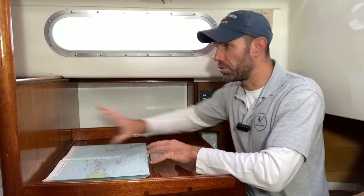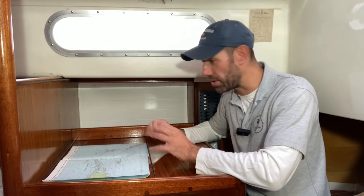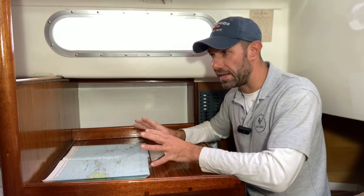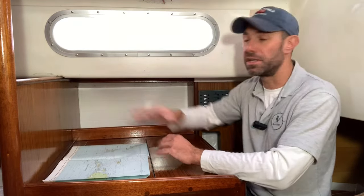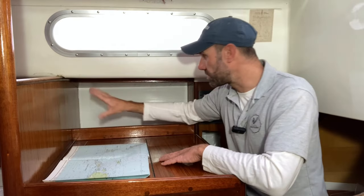The first thing I had to do was chip off all the horrible old formica. If you've ever done that you'll know how ridiculously razor-sharp that stuff is when it splinters and cracks, so there were a few nicks on my hands, but it chiseled off fairly quickly and cleanly. It didn't do any damage to the underlying plywood, which made it very easy to come in and re-veneer or re-coat all these surfaces with a new material.